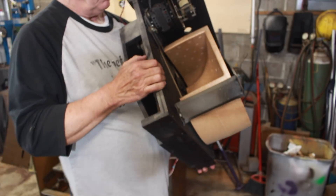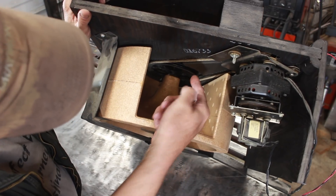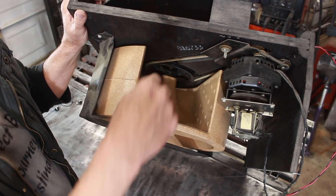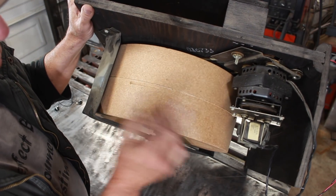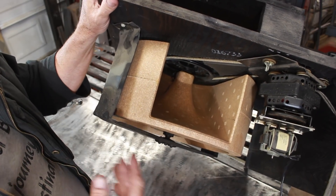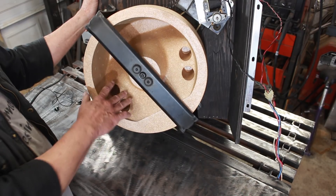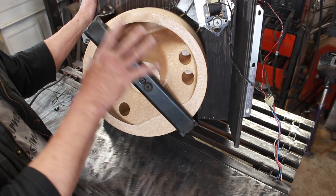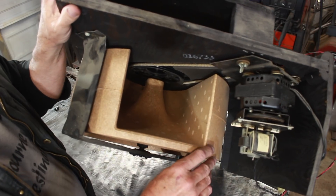I got this unit out. What we have down in there is there's a speaker on the other side of that pulley and it blasts sound down into this cone and this cone rotates. It's driven off this motor over here. As this port rolls around it creates various Doppler effects on the sound. I don't think this side has anything to do with the sound — I think it's just shaped this way to balance the wheel, because the business end of this thing is right there.